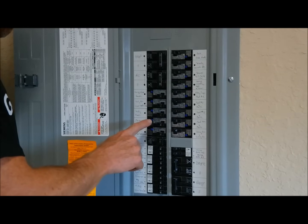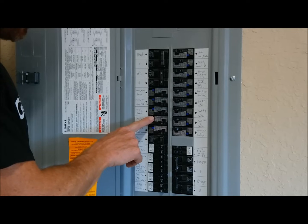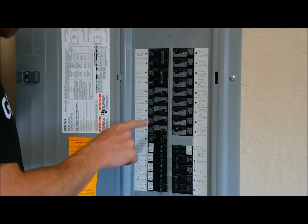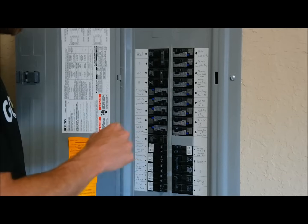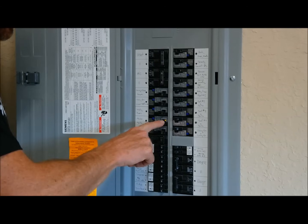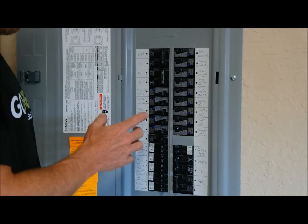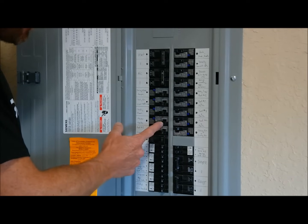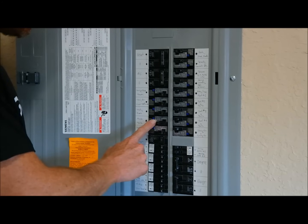The other set of breakers you're going to see up here are the arc fault breakers. They're on your standard outlets and your lighting. Those have a test button here. I'm going to press it to show you what it looks like when it's tripped — you see it moves to the halfway position. If you have a problem with one of your outlets inside, other than the wet areas that are on GFI, this is the breaker that will trip. Any number of these are broken up across the house in your different bedrooms and it's all labeled. What you want to do is make sure you go all the way to the off position first, then all the way back to the on position. You will see the test light come on — it's checking to make sure the breaker is fine. When it's gone off, you should have power again. If not, check the appliance you have connected to it. These also can go bad if it keeps flipping back to the halfway or fully off position as soon as you turn it on — like you switch it on and it pops right back right away — which could be a problem with the breaker itself or that appliance.